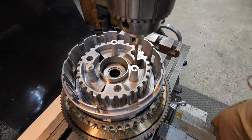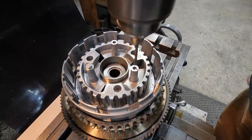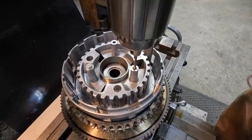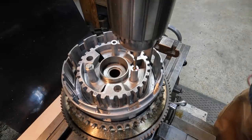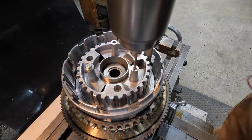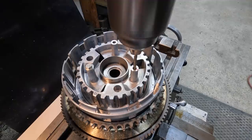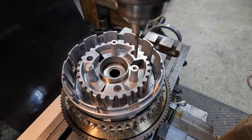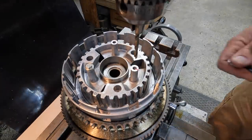I'm going to start with our five millimeter drill — just want to try to spot it. The thing I'm concerned about is if that screw is loose, which is going to be a good thing, is that as soon as I touch it with this drill bit it's going to try to screw it down a little bit. So I'm going to come down and start the machine up just above it so I don't come down and hit it hard. I don't normally like to let cutting tools rub, but in this case I want to very gently try to get the drill to cut in the center. I can see it trying to walk just a little bit. All right, I can feel I've made a little bit of progress there — you can see some chips coming out. So let's go ahead and put in our left-handed drill and see if we can get this to back out of there now.